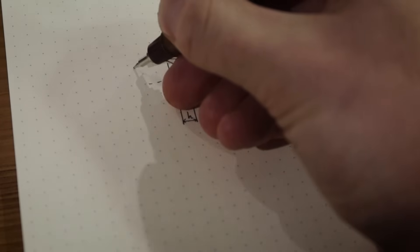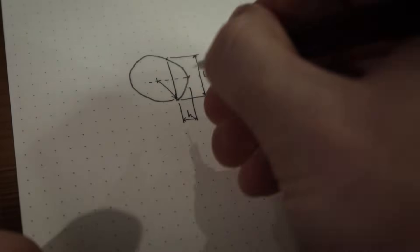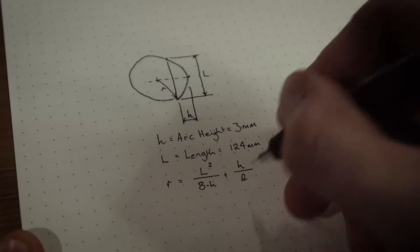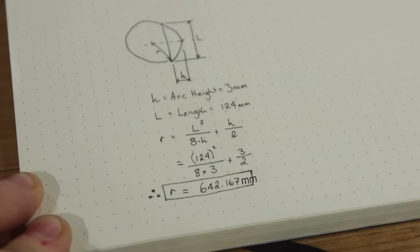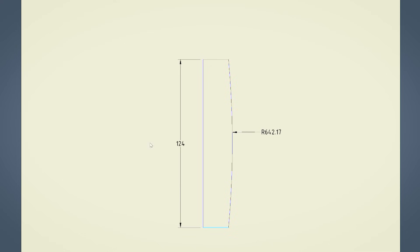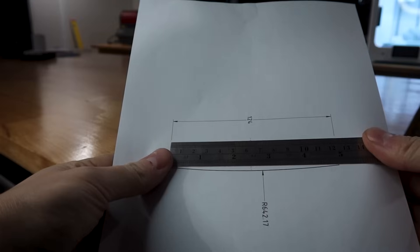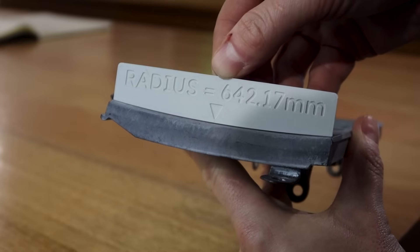What we've actually done so far is measure a chord of a circle. A chord is a line segment that joins two points on the circumference of a circle, and actually the diameter of a circle is its largest chord, which passes through the center. Half of the diameter is its radius, and with the information we've now gathered, we can calculate it. This is a simplified formula, but we can also double check it against what we've calculated with our CAD sketch. Then we could make a drawing with a couple of dimensions to double check our scale when we print it out — making sure our model scale is one-to-one — then carefully cut it out and hold it up against our part to compare. Or we could 3D print one and do the same thing. Which, in the end, is pretty damn close to what we approximated in the scan.